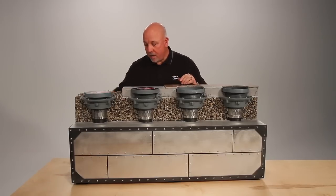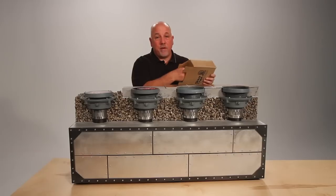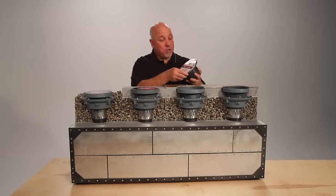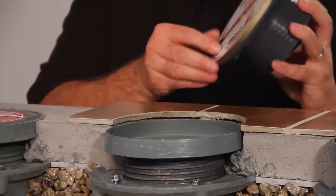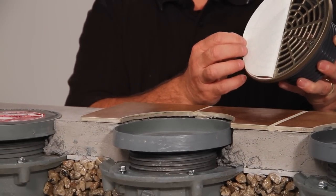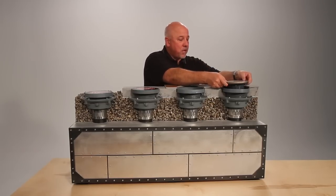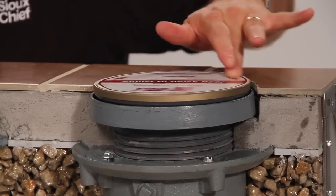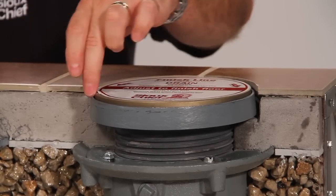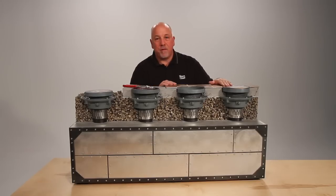The coring plug is set aside. Now is the time to come in with the finished fixture. The finished fixture has been protected in the job site trailer or somewhere off of the job site — it doesn't have any duct tape on it and it's a very nice clean fixture. Now with the finished floor covering in place, the finished fixture goes in and is adjusted to the proper level of the finished floor. A bead of silicone on the threads will lock it into place. The Finish Line — a perfect finish every time.